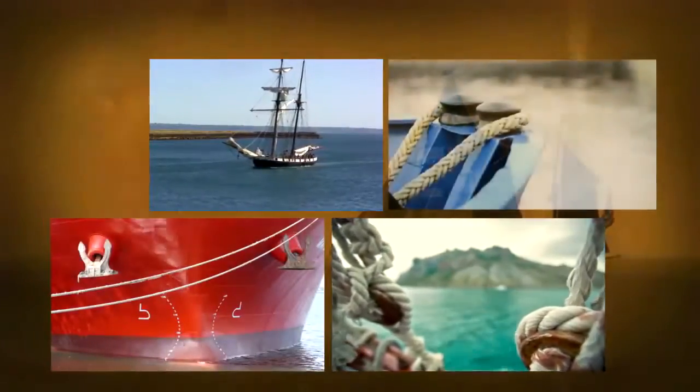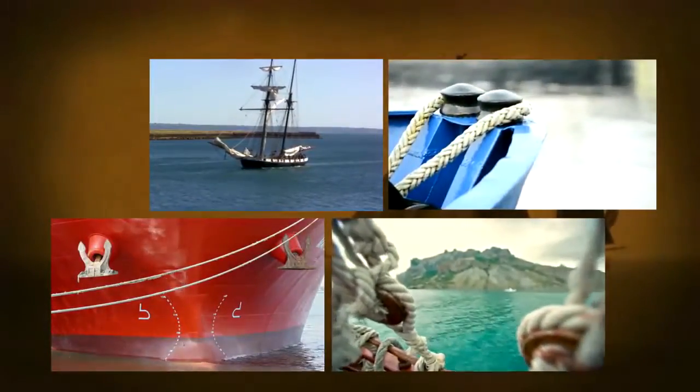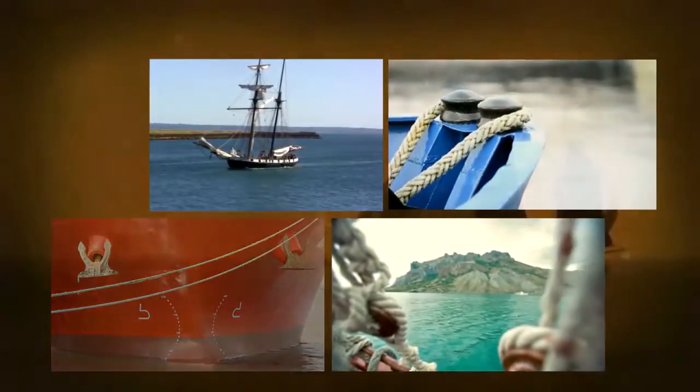Centuries ago, seamen in the Far East and Mediterranean used splices for their ropes, much like the ones we use today. One can use a knot, but knots are bulky and by their nature cut the breaking strength of the rope in half. The alternative is a splice. A good splice is capable of attaining 90% of the rope's breaking strength.